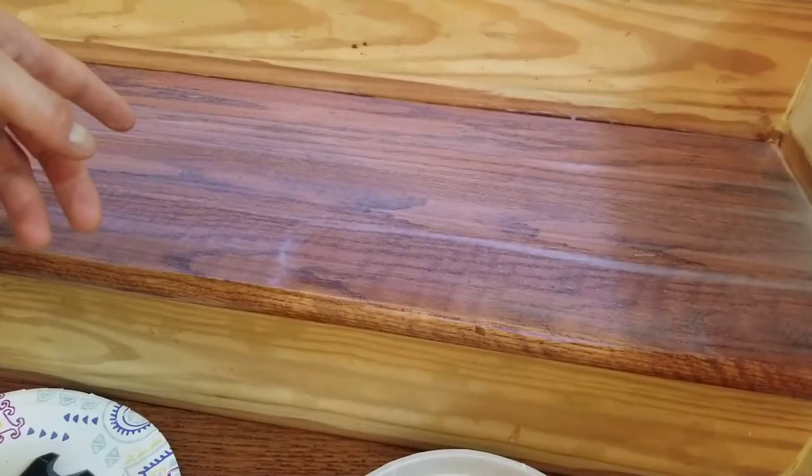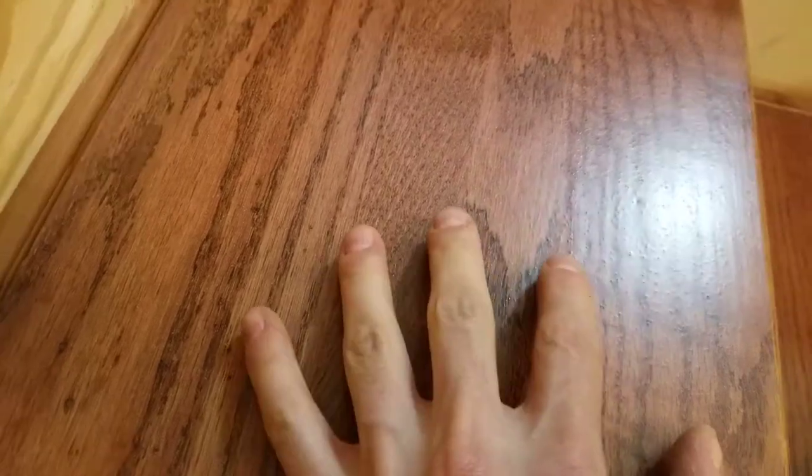All you do is let your finish or paint dry like normal. Once it has dried, it's time to test it out. I'm just feeling it along here — these are interior stairs, so I didn't want to go too rough, but you can still see the little additives in the light. At this density it's still rough; it feels like sandpaper, but it's not so rough that it hurts your feet. If this was an exterior application, you could go much more dense, which will give you much more grip. And that's how you apply an anti-skid additive.